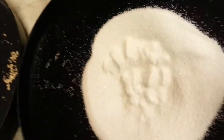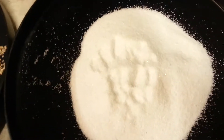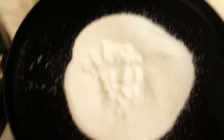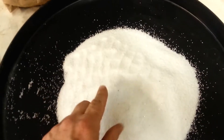It allows the water to easily surround each piece of calcite and actually dissolve it, and therefore raise the pH to 7 if you have acid water. Occasionally we may need to boost it with a little bit of magnesium oxide, but 90% of my customers that need some sort of pH boost are fine with just using Emory's Calcite in either a backwashing or an upflow neutralizer.